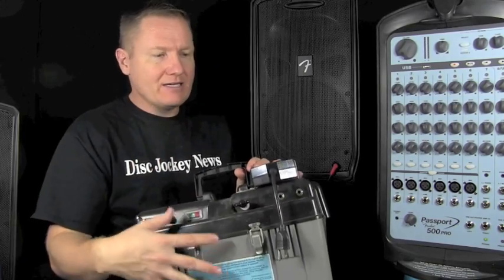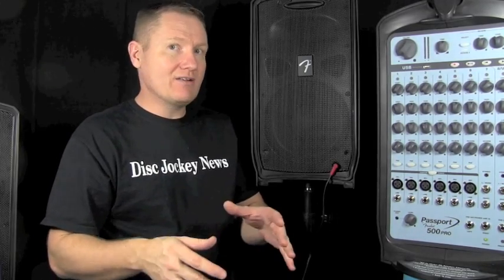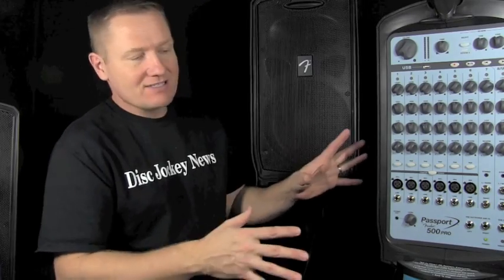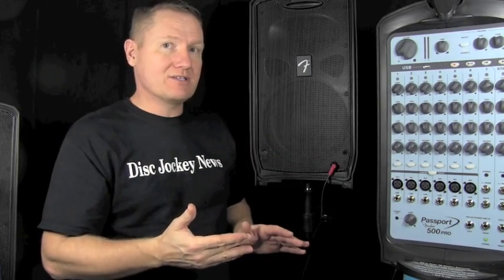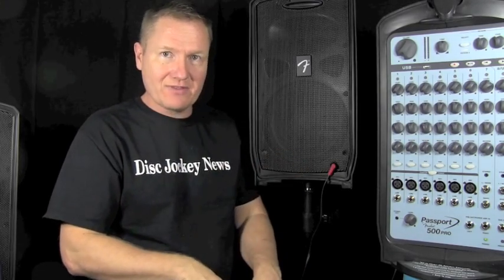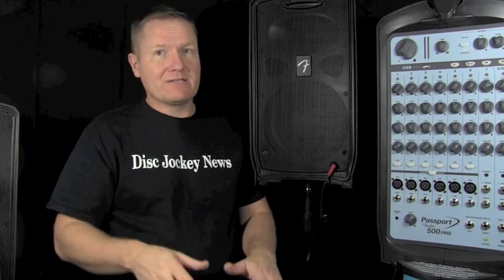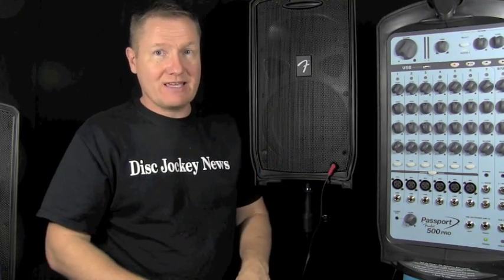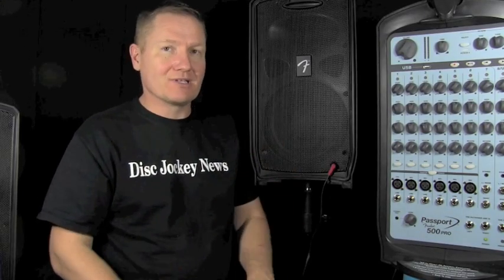You get the big battery in here and hook it up to that inverter. The inverter I have is a 3000-watt inverter, which can run at 1500 watts consistently and bump up to 3000. I'm hooking a Fender system up into it — this is the Fender Passport 500 Pro right here, a 500-watt system for output. We hooked this up to a kilowatt meter to find out what it could do, and in its time of running it never exceeded 100 watts of output drawn from the inverter. I've also run the older Passport 250, which has a smaller amplifier. The 250 I ran for eight hours wide open outside, and the battery still showed 75% charge after eight hours of running. The Fender Passports and similar smaller sound systems are really quite efficient.